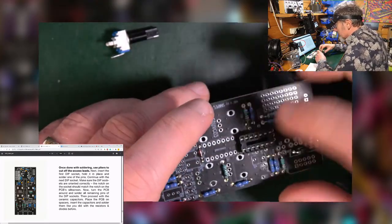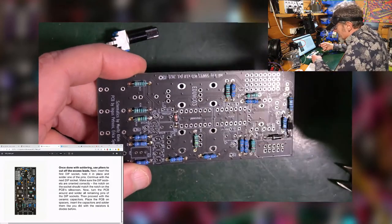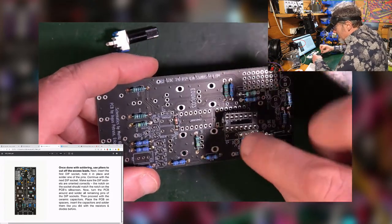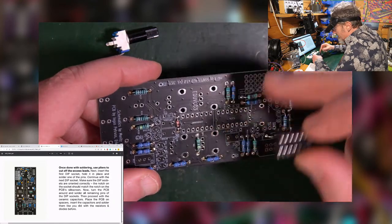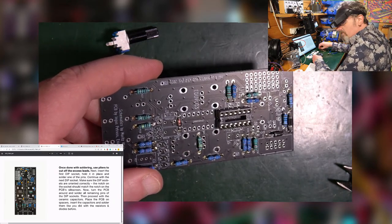So do these first. You've got a little nodule. This is just a holder for plugging the chip in, so it doesn't actually matter, because it's not wired to anything. But you want to line up the little nodule on the socket with the nodule on the screen print, so that you can then line up the nodule of the chip that goes on it. Got it? Good.